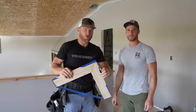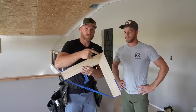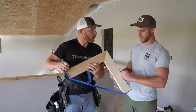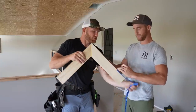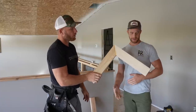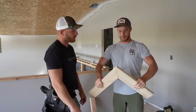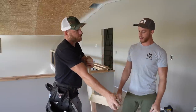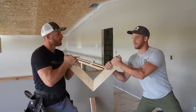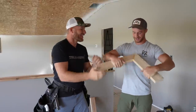So this is the test fit we did — this is only glued and biscuit jointed, to demonstrate how strong a joint is. Not only do we have this on all of our window miters — which are not only biscuit glued but also pocket screwed with the Kreg jig — but I set this up and it's been over 24 hours. Go ahead and try to just see how strong it is. It is pretty strong — you can feel it, it's solid. Let's see what it takes.